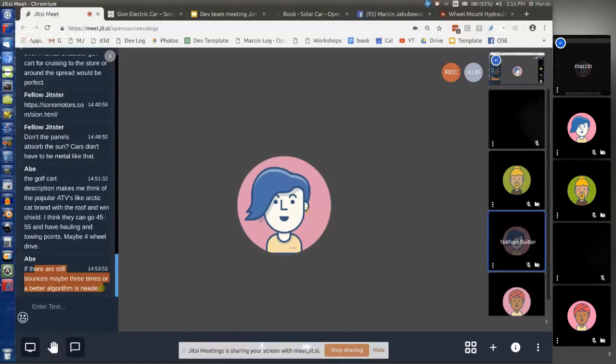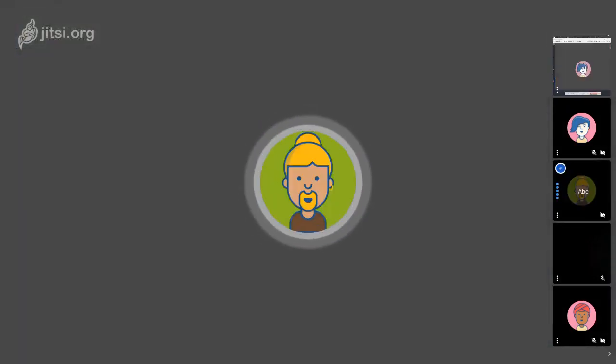Like if the debounce time is 20 milliseconds, you might do a delay between one direction of motion and the other direction of motion by more than 20. So I actually tried a debounce time of 50 milliseconds and a delay time of 100 milliseconds. I'm going to work those down probably to like 20 and 30. I was just making sure it worked. If it needs to be longer, that's always an option.